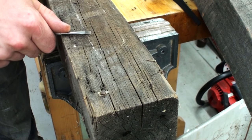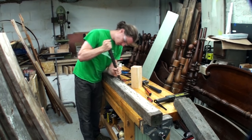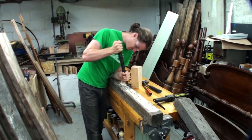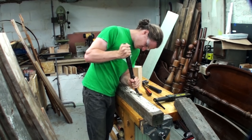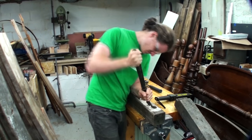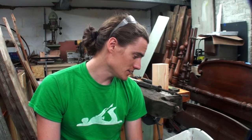A staple can do a lot of damage to a planer blade; a saw with carbide teeth will go right through them, but try to get as much out as possible. That's it for pulling nails on this particular wood — I've probably got about 30 minutes in pulling nails, so that is additional time into the project. After you've gotten everything you can possibly find, go back over it with the metal detector and just see if you got everything.